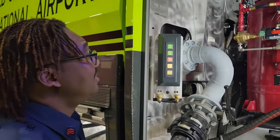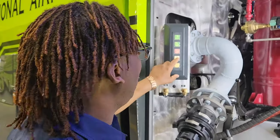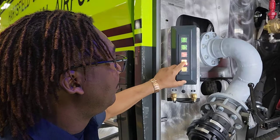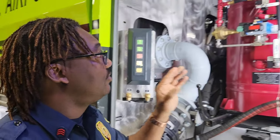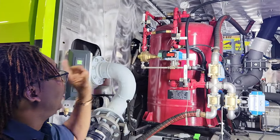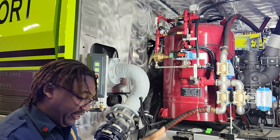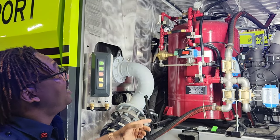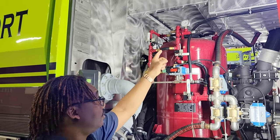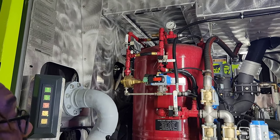All I'm gonna do next is turn on the Purple K — turn on the system. You have to hold this down. You heard that? What just happened was it used the residual pressure in the line and shot a shot of nitrogen into the vessel right here. It just fluffed it. So you don't have to pop the cap or anything. Now that I've done that, I've put a little pressure on this pressure gauge.